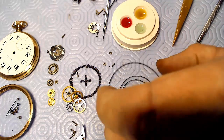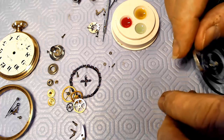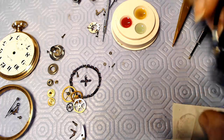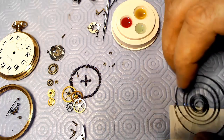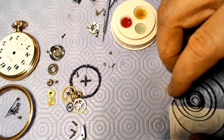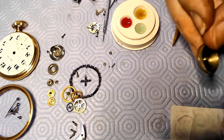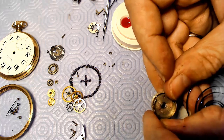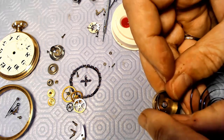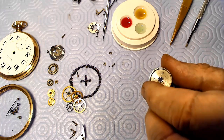So, I'm going to do it with my hands. I hate to do this, but I do have mainspring winders and all kinds of other tools. But now I said this thing goes clockwise, right? So I'm hoping that I put it in the correct way. So what I do is I'll find the little notch here where this goes in, and I'll put the mainspring in that notch, and then I'll wind it in by hand. And I've got other videos on that, so I'm not going to.